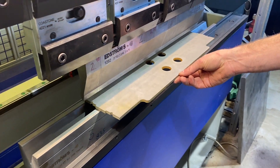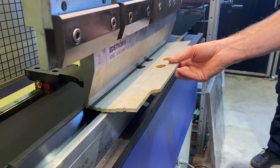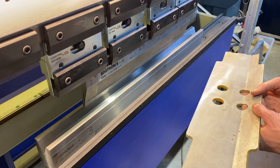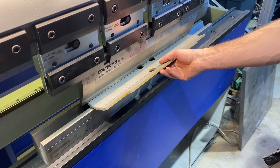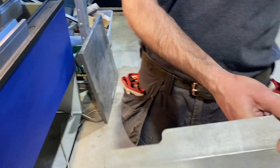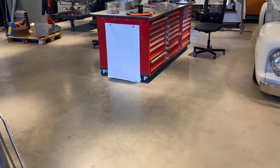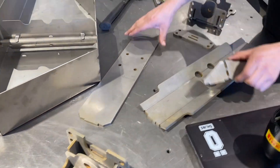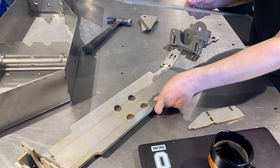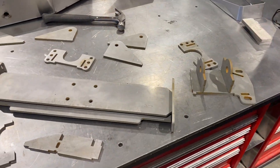The brackets are water-jet cut in six millimeter steel, but the press-brake has no problem giving it the shape and bends required for this puzzle. It's like butter — we just bent it in six millimeters. It's only six millimeters.